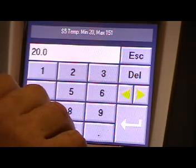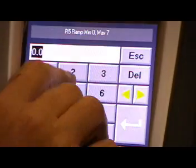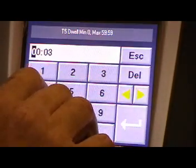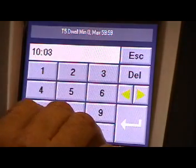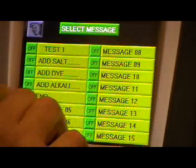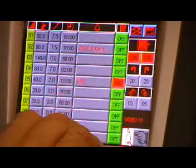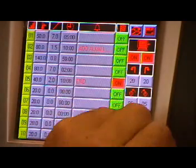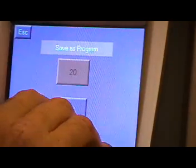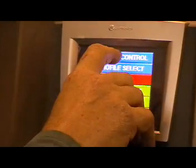After that step, we want it to cool down to 40 degrees at 2 degrees a minute, and hold there for 10 minutes, and then end. So we put the end message in and we turn the off to on, and that will be the end of process. We then save the profile, saving it as in position 20, and then go back to the profile control.